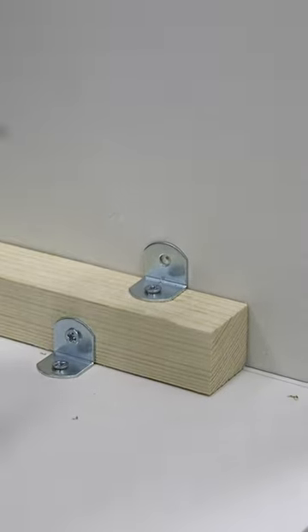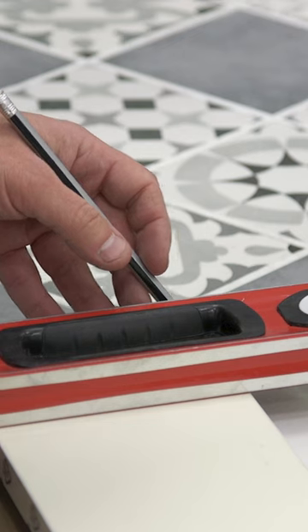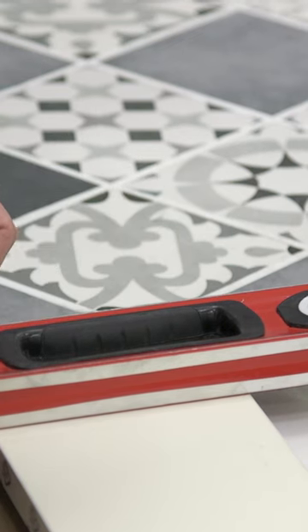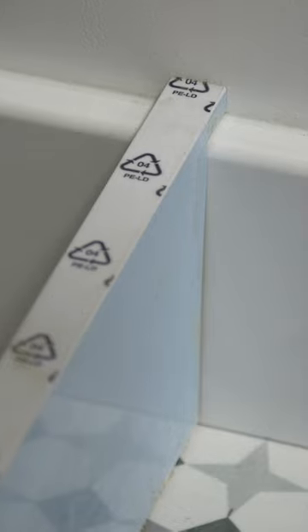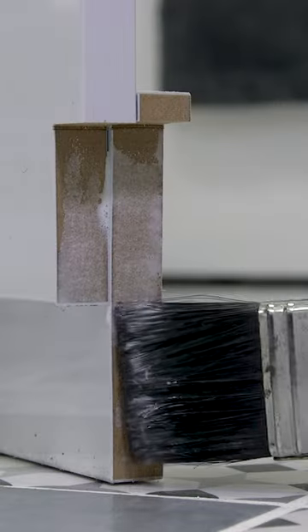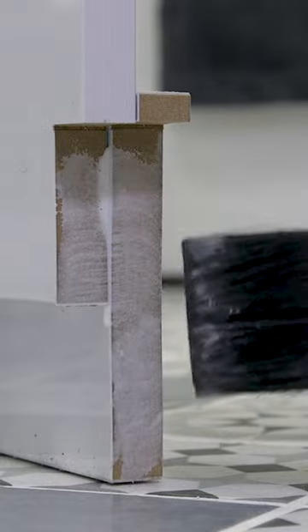The baton should be high enough up the panel to allow for the plinth. Once the main panels are joined you will need to cut down the plinth. Any cuts that you make should be from the wall end of the plinth, and you will also need to allow for any skirting boards or pipes. Any cut edges of your wood should be sealed with a PVA mixture or varnish to alleviate any water penetration.